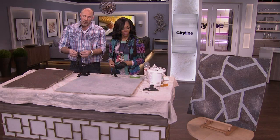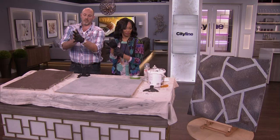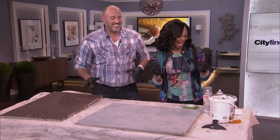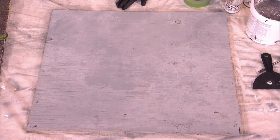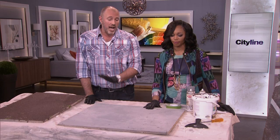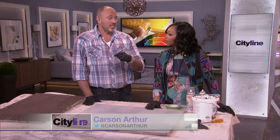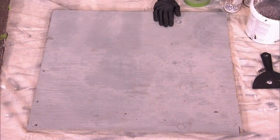I love that you're putting on the black rubber gloves — we're getting into this. Well, we're going to be dealing with concrete, sticky stuff. I saw a segment where you said to Mike Ward that you love the black rubber gloves. They're just a little bit more classy than the translucent ones — I think they make my hands look skinnier. So I brought plywood, and the reason I brought plywood is because it's rough. When you're working with concrete, it is also going to be rough. So the first thing you need to do is prime it. It should take about half an hour. You're going to paint a good floor primer — you can get them at any box store. It doesn't matter the color, but I like gray because it's going to be the color in between your grout lines. Once you've painted it and let it dry — you've primed it. You don't even have to clean it first. Just prime it, just go right over the top, because you want it rough.